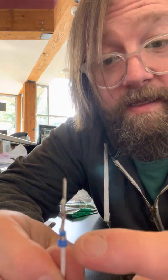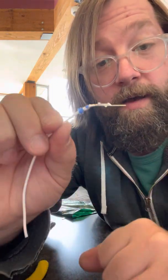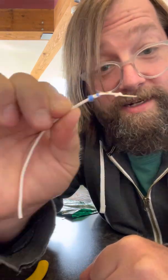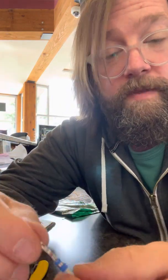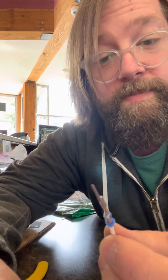So I have a feeling the sealed portion is going to be your culprit, unless when you're crimping, it's creating a bend like that, and you have to do this motion because straight won't let it go through. So you want to make sure that that's nice and straight. Majority of the time when people have problem inserting this into the cavity, it's going to be that sealed portion. That is always the biggest culprit.